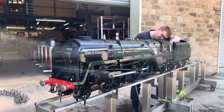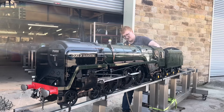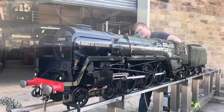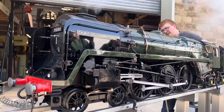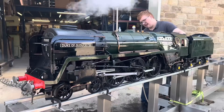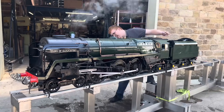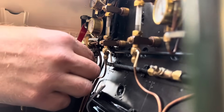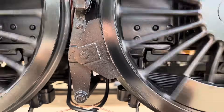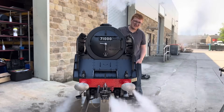And we have success. We actually had a minor problem here — there are steam operated drain cocks on the locomotive which ideally we would have had open at this point. But we found that because we're on the rolling road and there's no load behind the engine, the pressure in the pistons in the cylinders was never getting high enough to knock those steam operated drain cocks open. So we've since put springs in there to help them open even under light loads. We've simulated a load here with the brake block — if John operates the steam brake you'll see the brake block move onto the wheel, creating a resistance that simulates a load. Now the pressure in the cylinders goes right up and the steam drain cocks open.